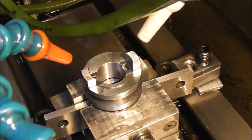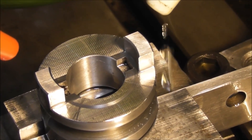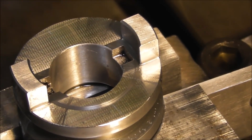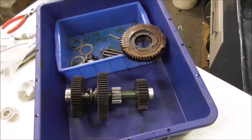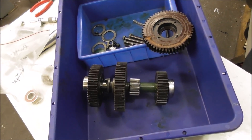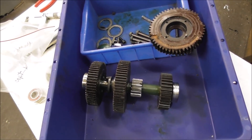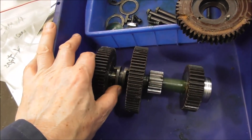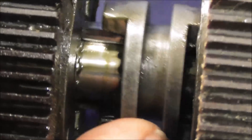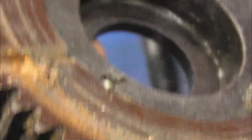I've just stopped it to have a little look. It's only been running for about a minute and it's cut down a couple of millimeters deep, so it's cutting pretty aggressively. Looks like this will be an easy job. I like this type of repair job — one of my clients has a good quality Swedish drill press and the operator crashed it. They tried to change gear while it was running, and the little sliding coupler gear that runs on two keyways engaged in the drive dog, locked up, and smashed the gear and the coupling.